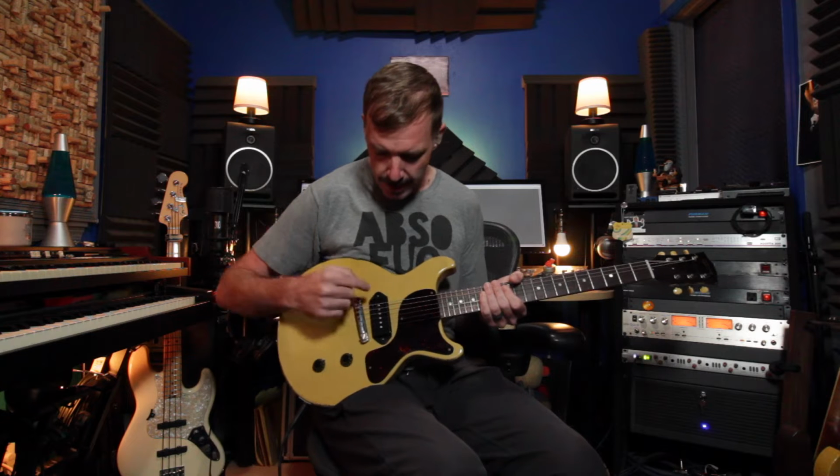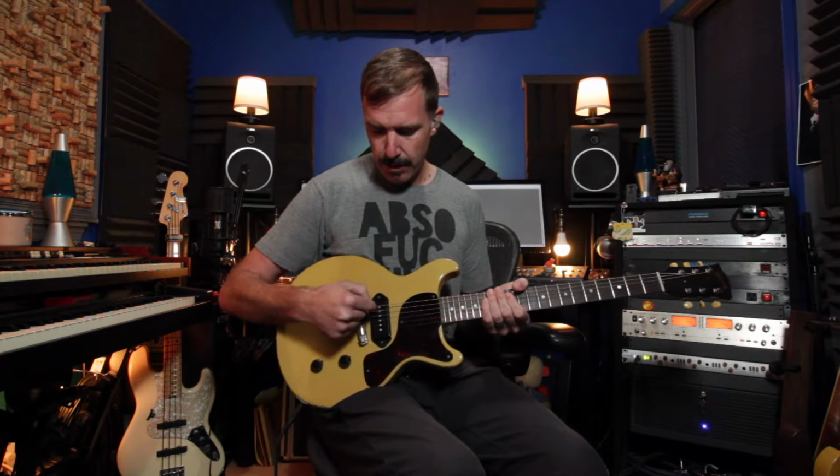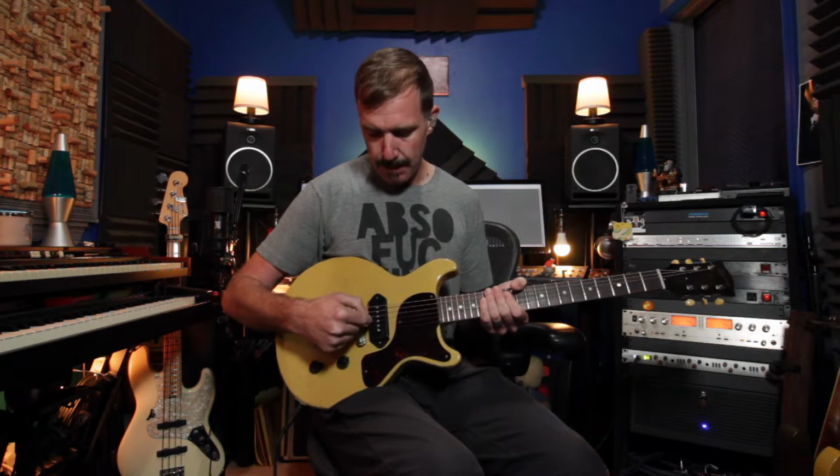The bottom line is a lot of people imply Mojotone has the vibe right with their proprietary way of wiring it noiseless. And I'm not entirely sure how this works, but the basic gist that I got was they wire two separate pickups in here. The first upper three pole pieces is one pickup, and the bottom three pole pieces is a separate pickup. And so they can reverse the polarity or reverse the winds of copper between those two pickups, and that will in and of itself create some noise canceling.